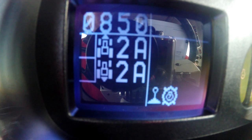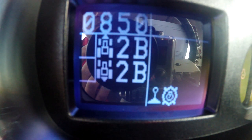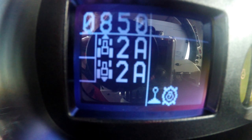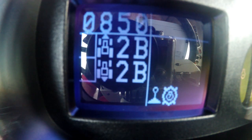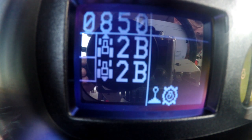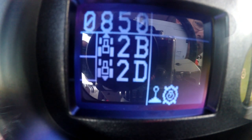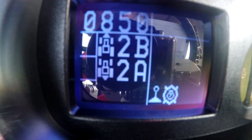That beep means that we are in the turtle mode. From neutral position, push the orange button and it's going to change to the rabbit. But we're going to stay in turtle mode to show you how to change the forward speed. You push the button in and push both forward, and you will see that it went to 2. If you want to save the reverse, you move the T-handle back and you can adjust the reverse direction opposite of the forward direction. Here we're at 2B and 2A — that would be a nice takeoff speed for good loader work.